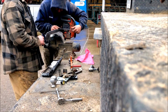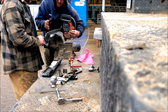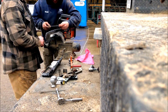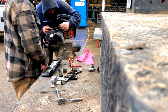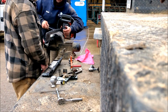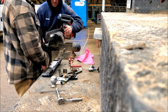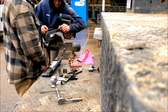See, that one runs that round. It's semi-chisel, and you file it steeper back, and you switch back and forth from it to this. The chisel chain ain't meant to be kicked back that far, but that other chain you have to kick it back far. That's how you do a round style tooth chain, you know. If you got a round tooth chain that you're used to running in dirt and shit, and you want to make it bore, they are impossible to bore. You got to get them steep and deep, you know, to get them to do anything.